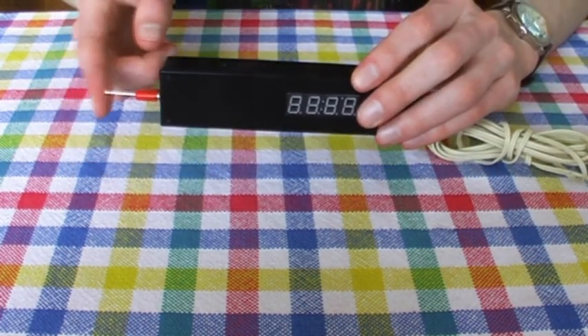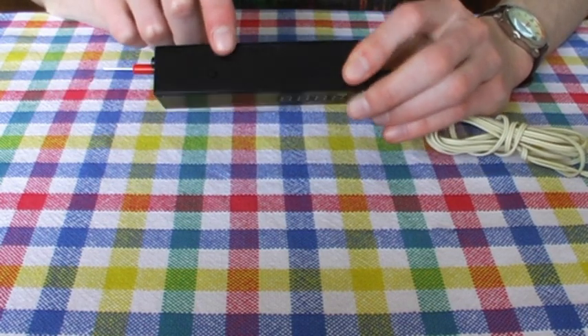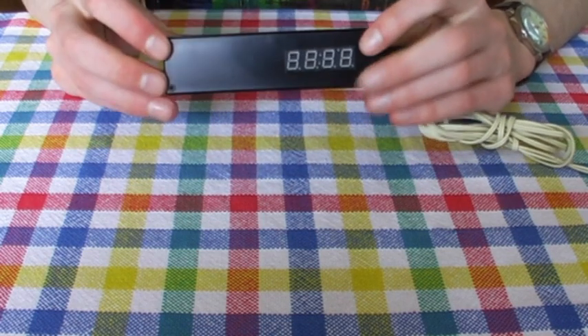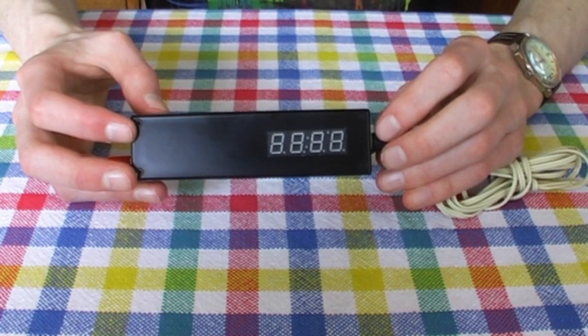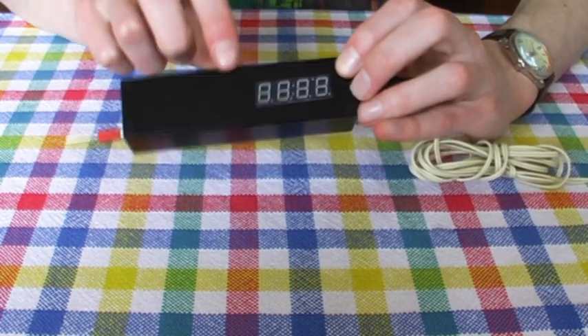The probe tip is simply a darning needle. Aside from the power switch, the user input comes from these two buttons — one at the top and one on the bottom. I think I'm slowly getting better at working with plastic, helped by a new and more precise high-speed rotary tool. This is the first project where I've had to leave holes that are not concealed by an external nut or lip to hide rough or wobbly cuts — two round holes for the buttons and a rectangular one in the lid for the display. If anyone has any tips for working with plastic, I'd really appreciate them. One thing I learned with this project is to wrap a piece of masking tape around the tip of needle files when using them to neaten the edges of holes — all it takes otherwise is one slip and you've got a nice deep scratch on the enclosure.